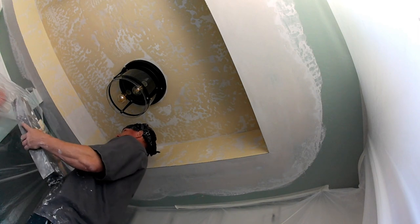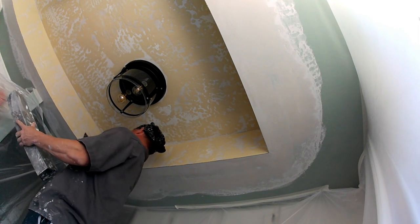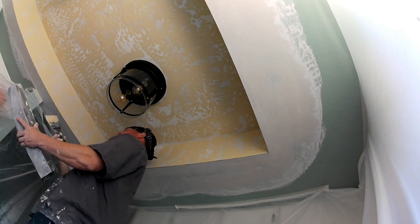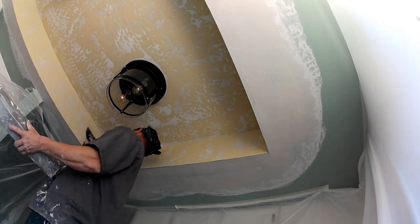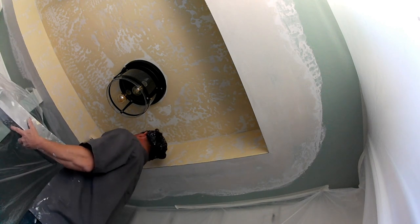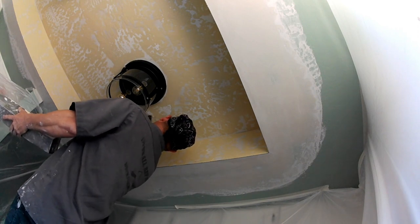Finish up here. Yeah, I know this is a lengthy video, but this is what it takes. These jobs take hours to do. You can also jump in my other videos. I have shorter videos and smaller patch jobs. The routine is pretty much the same. Get it sheetrocked, get it taped, coated 2 times. If it's really bad, coat 3 times, then texture.